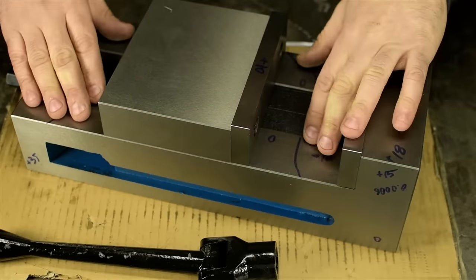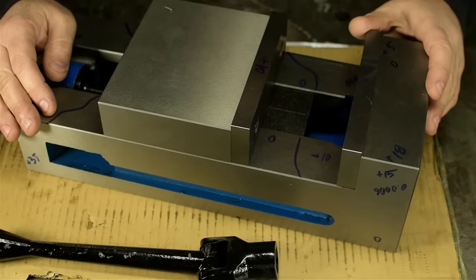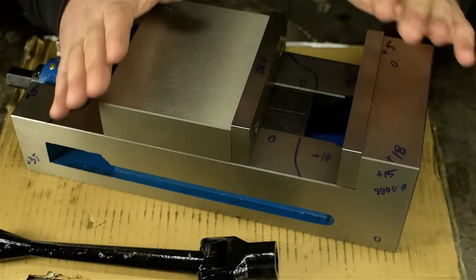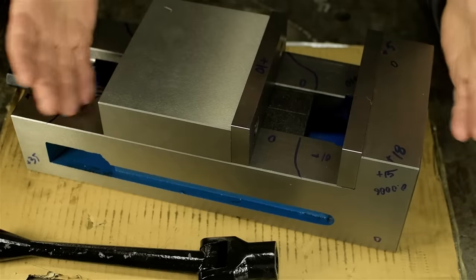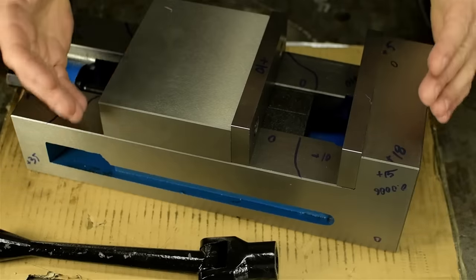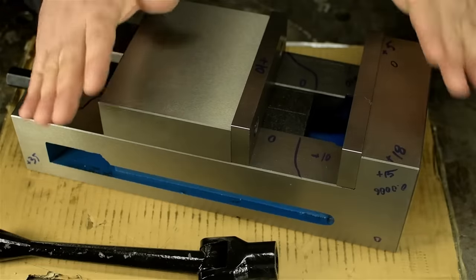They maybe did this fast and hot, and the middle came up. Or the palm sander they're using to surface grind this needs to be dressed. But here's the thing. Ideally, a good vise, properly mounted, should be almost invisible to use. Like it becomes part of the milling machine that you trust. Sure, you have to use proper technique, make sure everything is clean, etc.